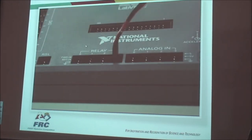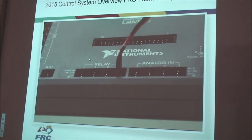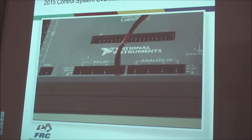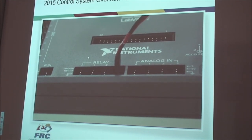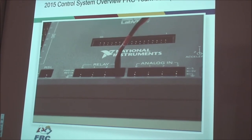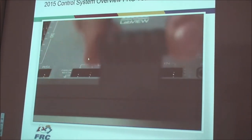One last thing to know about wiring is the space between PWM pins on the RoboRIO, in that there's a lot of them. We found that this spacing can cause problems like bent pins and loose cables, so we came up with a few solutions. First is just trying to tie the cables down tight. No guarantee that this won't bend the pins, but it does help with cables becoming unplugged.